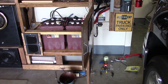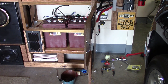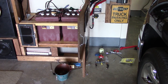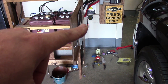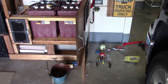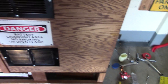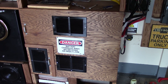Hey, how we doing? Chris here. So I got the Trojans in, everything's good to go, but I ran into a problem with my Blue Seas switch fused down here. So I installed a 200 amp Blue Seas circuit breaker. I'll get right to it and show you what's going on. I also put in two vents for the cabinet door for the battery bank.